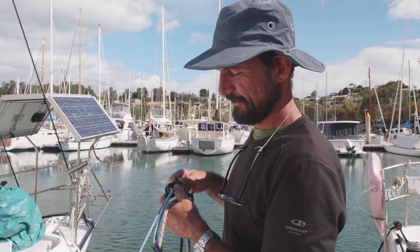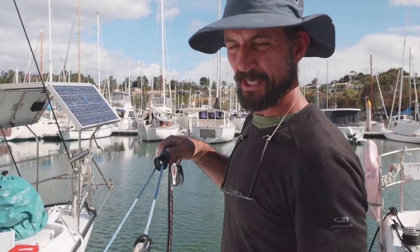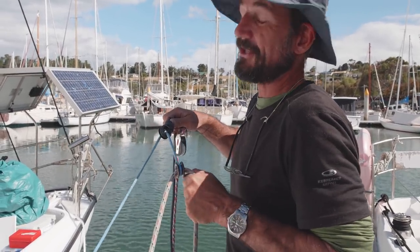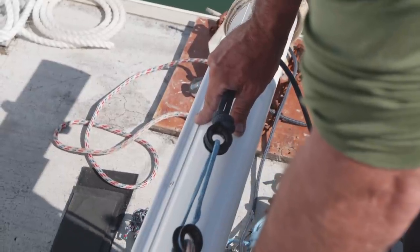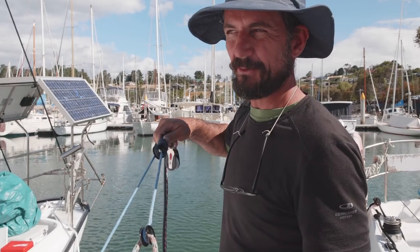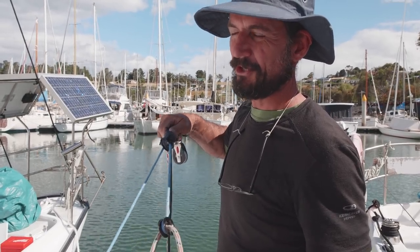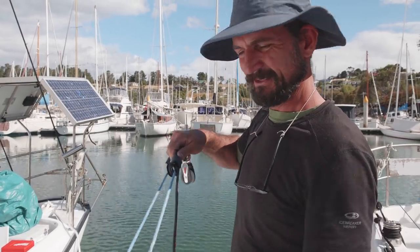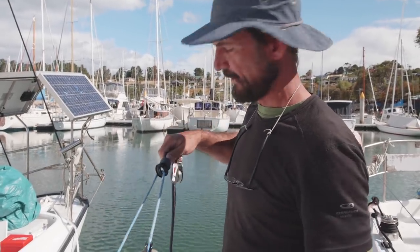There's not enough force. So we'll be able to just go to the gooseneck, like on the boom near the mast, and be able to pull it by hand and make it off on a cleat. One more thing that we don't have to lead to a winch. That means no jammers, that means less holes in everything. One more advantage of a 30 footer.